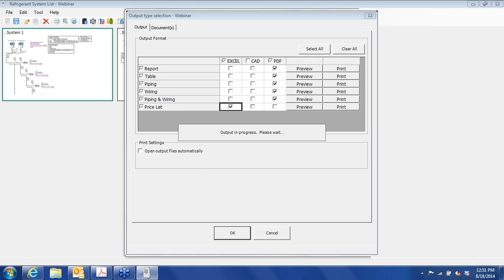Okay, we have a question that I'll address while we're waiting for this. Defrost. Okay, a couple things. I'm glad somebody asked that question. When the contractor installs this equipment, it's a heat pump, so it's going to go into defrost mode. The reason that we need to defrost is when we're pulling heat from the outside, the outdoor coils on the heat pump are acting as evaporators. During certain temperature and humidity ranges, say from the low to mid-20s on up to the mid-30s or so, that coil is going to get pretty cold because we're pulling heat out of the air. Frost may form on it.